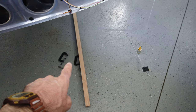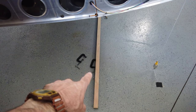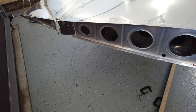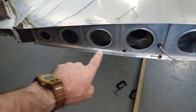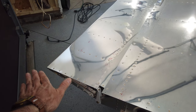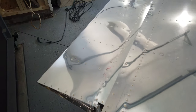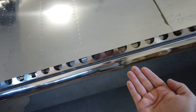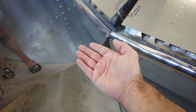I reclamped my straight edge piece - I've actually labeled this and kept it from when I built the wing, so it's the exact same piece I used before. I used that piece across here and extended it out past the aileron. You set up your straight edge using the tooling holes, then hold the aileron in line with that reference. With the aileron lined up correctly with your reference lines, it is in trail with the wing. Pull the flap up - perfectly in trail with the aileron - and it comes up very nicely and touches the bottom of the fuselage. I've done that on both sides.